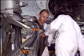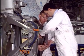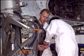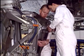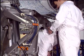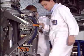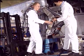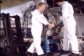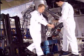Now the tool maintaining the shock absorber in partially compressed position can be removed. Caution! Take all safety precautions as the tool is very heavy.